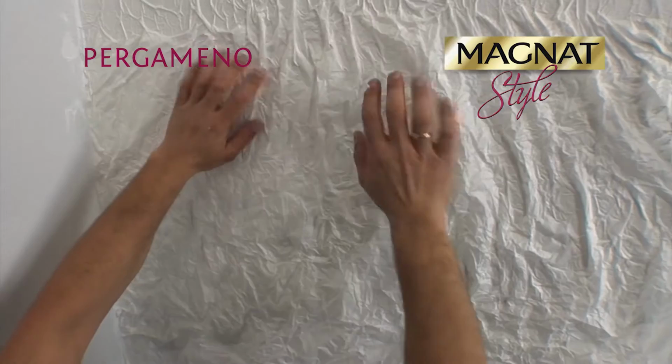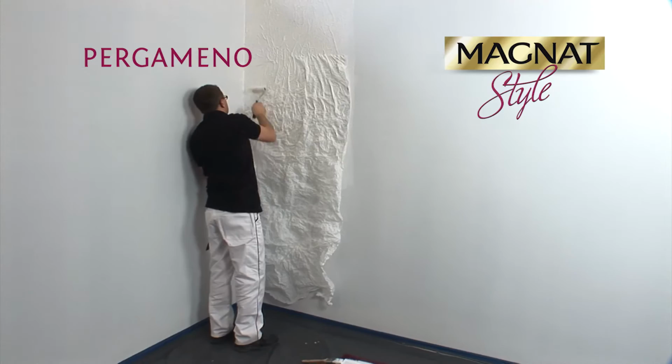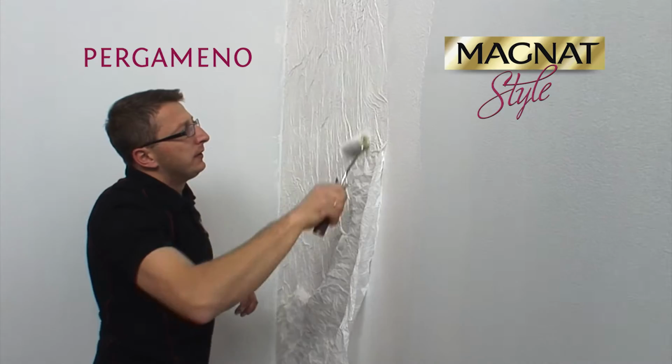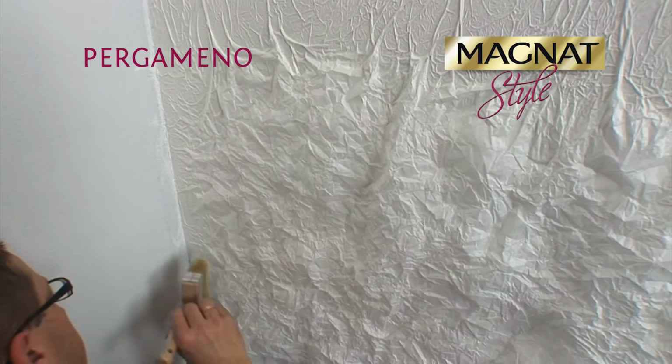Note that the paper quality allows some corrections to the texture, but when the paper has soaked much of the distemper, the corrections are limited or no longer possible. Form the texture by hand. Use a dry roller or a wide brush to thoroughly remove air bubbles from under the texture.